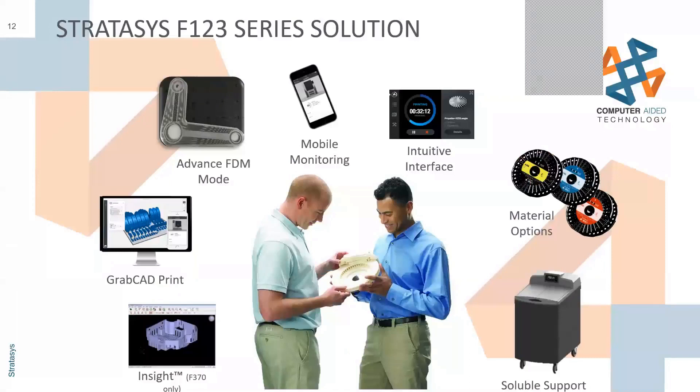Inside the F-series, we have new material options — now it's easier to load, cheaper on the pocketbook, and better quality material. You have great software behind it, like Insight for familiar high-end machine users, which allows you to dive into the STL, split it into two builds, create groups, layers, and really modify line by line, layer by layer, toolpath by toolpath. You also have the GrabCAD print option, which allows mobile monitoring — you can log in from your phone at home over a weekend to check in on the print and see how it's building.